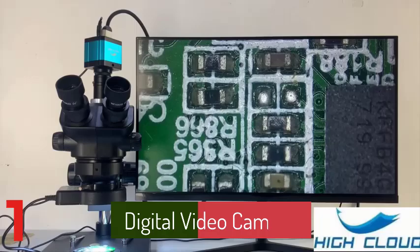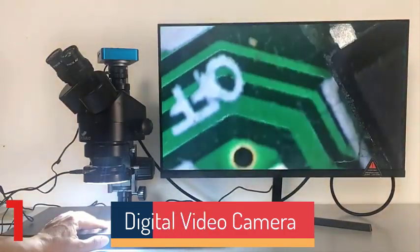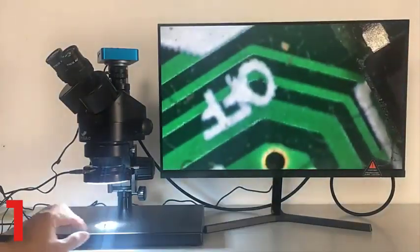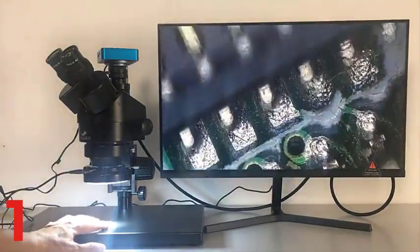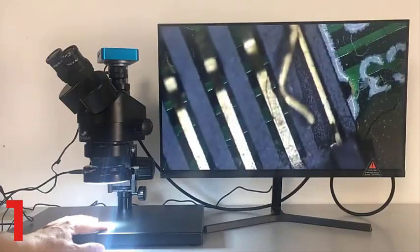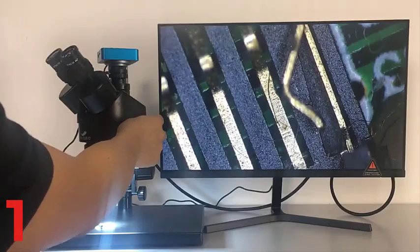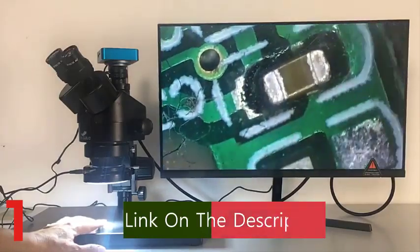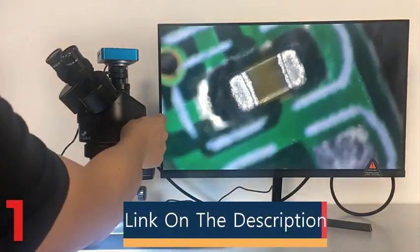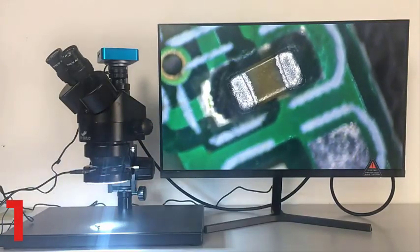Number 1: The RF-4 Trinocular Stereo Microscope Set is a premium tool for precision tasks like soldering, PCB repair, and intricate inspections. It offers continuous zoom magnification from 7x to 50x and a 0.5x CTV synchronizer for seamless camera adaptation. The set is built with durable metal material, CE certified, and features a 144-LED spotlight, dustproof lens, trinocular drawtube, and articulating arm stand with 360 degrees rotation. Its mechanical gear zoom locking knob ensures precise magnification.